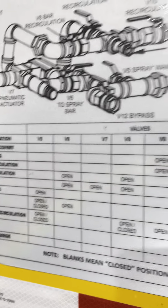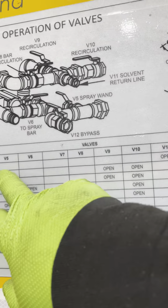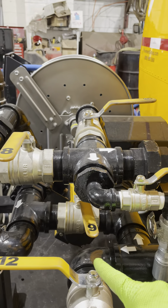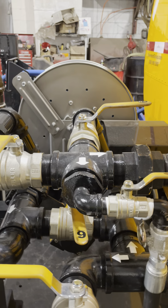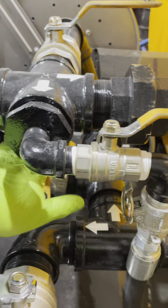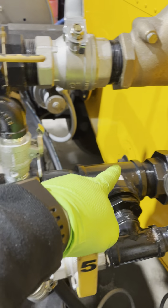Now we go back to the rear of the machine and consult solvent recovery. It will tell you about valves five through twelve in their positions. In order to recover all the solvent out of the system, number eleven is our return to solvent tank valve. Right now we're passing air through the front — it's going to come in and come right back here. Wherever you direct it from here is what's going to clean out with air. So we will also open valve six.